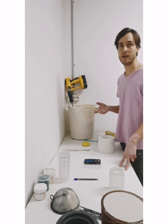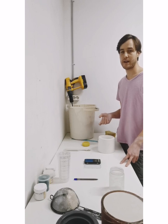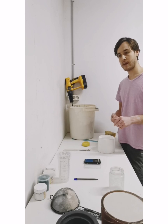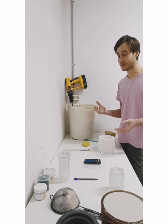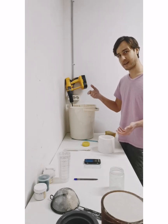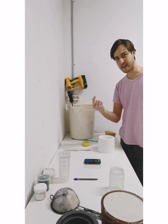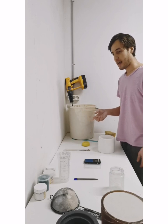Then you're going to want to dilute in water a 50/50 mix of sodium silicate and soda ash, and add that in drop by drop, very slowly, keep mixing. Pretty soon it should get to the point where it's a super thick pudding, but thin enough that you can start mixing it. Slowly add more drop by drop until you're able to pull a vortex or at least get it thin enough to work with.